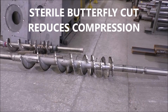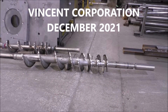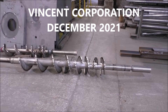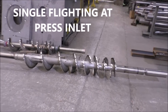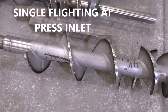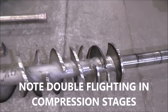This is the 1st of December 2021 with Vinson Corporation. At times we have to severely reduce the compression of a screw in order to prevent jamming of material. You can see the screw has single flighting along the entranceway, and each stage of compression has two flights — one, two, one, two — so it's double flighted.